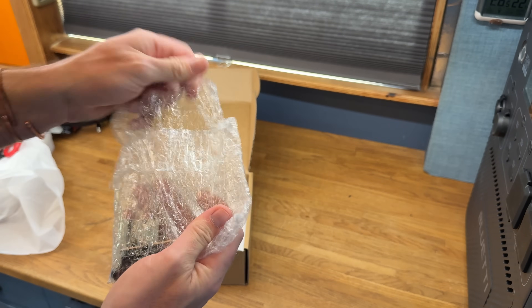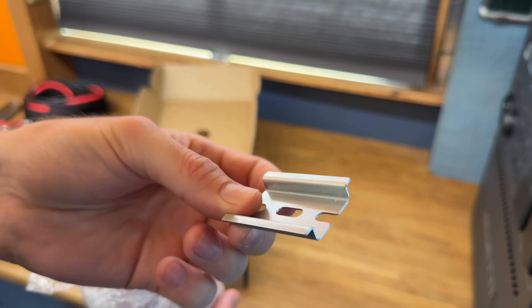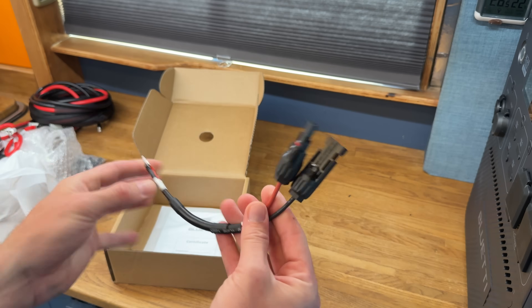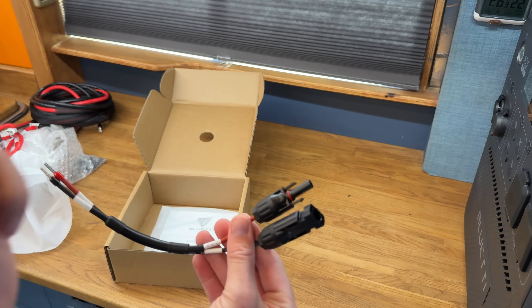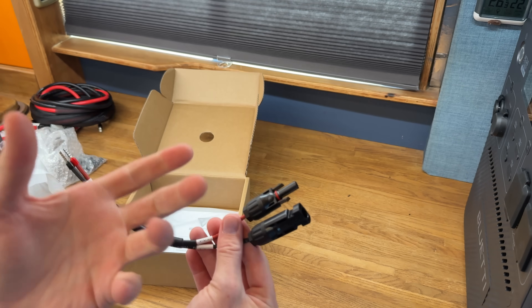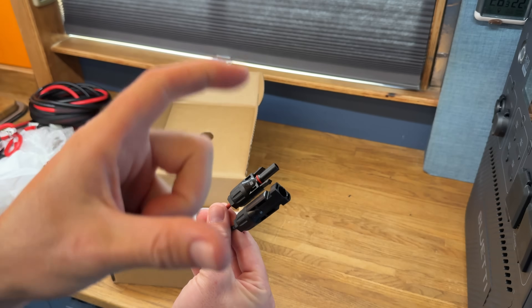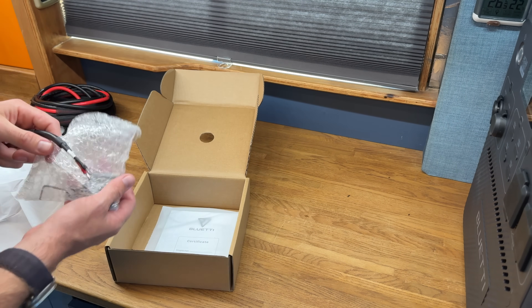Whilst I was going on about it being DIN-mounted and why would you do that — because not many people have DIN-mounted options — it does supply you with a small DIN rail, which you can mount that breaker on, along with a bunch of hardware and screws. This is the main output cable with MC4 connectors. The reason for MC4 connectors is that you're using a solar port. Whilst most power stations use an XT60 or XT60i connector and some use barrel connectors, they're usually coming with their barrel or XT60 connector to MC4 connections, so you can undo those MC4 connections, put them on here, and have that go into the output of the charger.